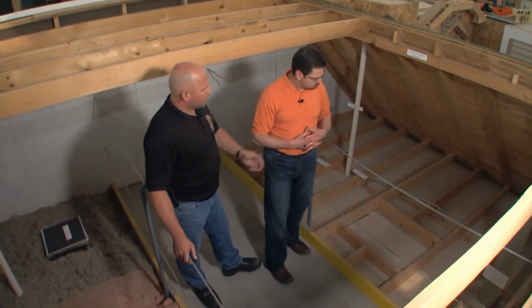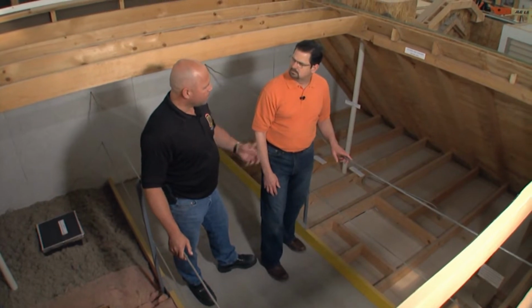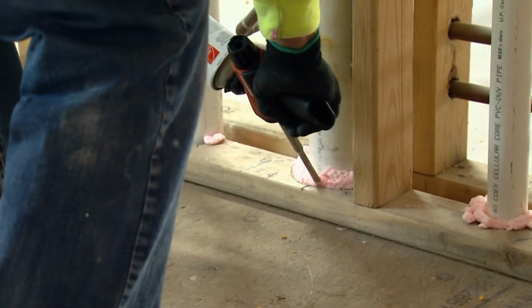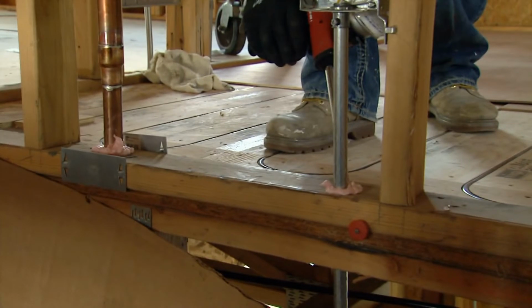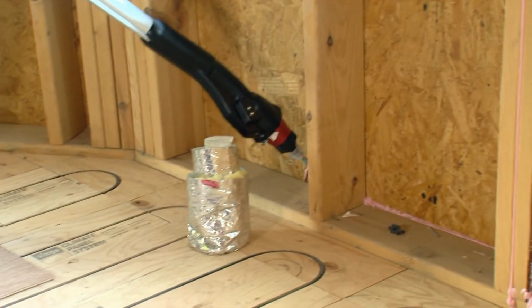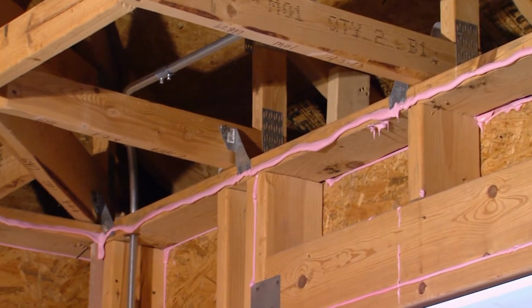interior walls. We have our ceilings drywalled. And then with the electricians making their holes through there, the plumber making their holes through the actual attic floor, our scuttle hole, our flues, we're going to end up with basically areas that we need to air seal. Okay. So once we air seal it, then we're able to add insulation. But we want to make sure it's air sealed prior to insulation.